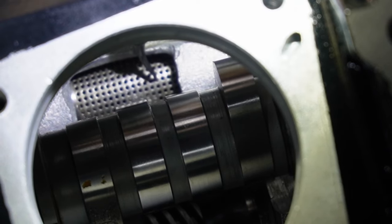There doesn't have to be much movement there as long as there's movement, so that it's not crushed out — that's what we're looking for. If you follow up with the manufacturer specs, they say they can be up to 50 thou end play in them; I'd like to get them closer to 10, but 15 is quite acceptable.